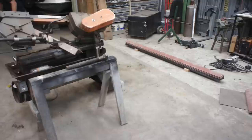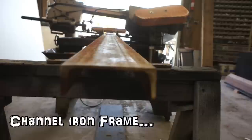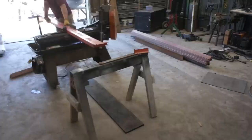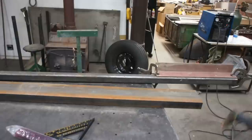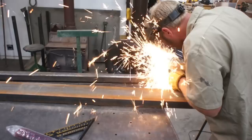I also knew that I wanted tandem axles with electric brakes and a minimum of a 6,000 pound rating per axle. So I kept my eyes peeled on the local classifieds. Now, having owned, built, and borrowed a few trailers over the years, I knew that my ultimate trailer would be a tandem axle deck over. A deck over trailer is a trailer that has the deck over the axles, meaning the entire trailer deck is usable space. You're not working around fenders.